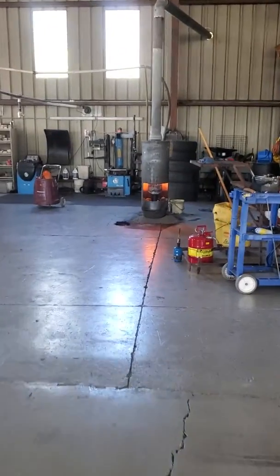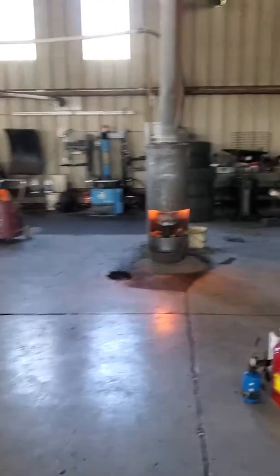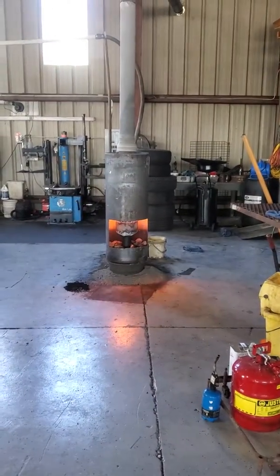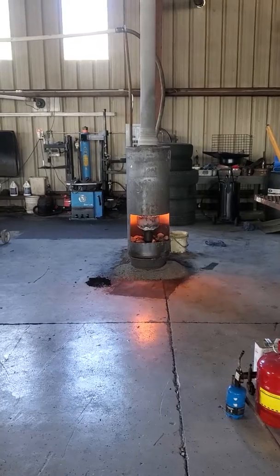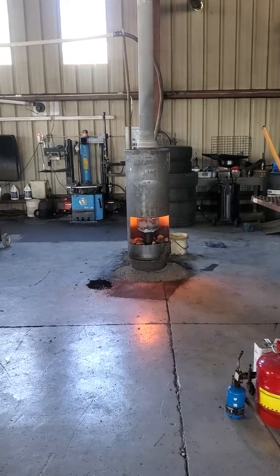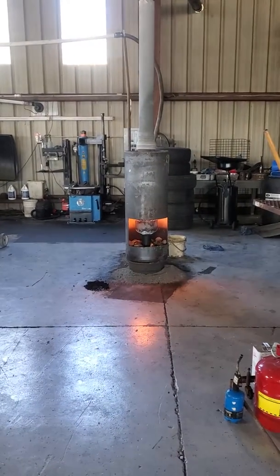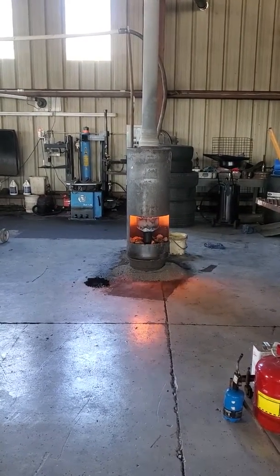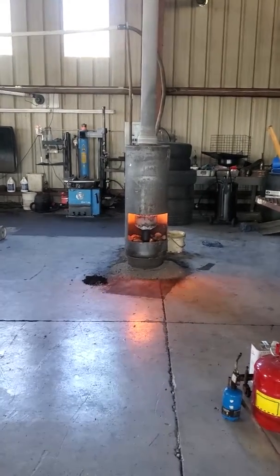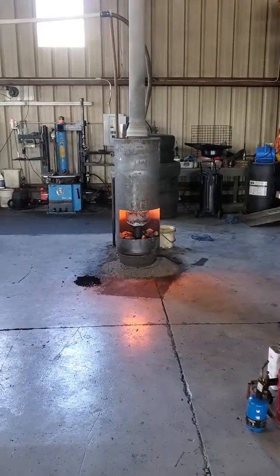Fundamentally, it's a drip oil furnace, and what makes this work so well is the combustion air, the burn bowl, and the burn plate — things I've worked through in design. I got the burn baffle idea from another YouTuber and kind of turned it into something a little bit better. I don't see any designs out there quite like mine that work as well.